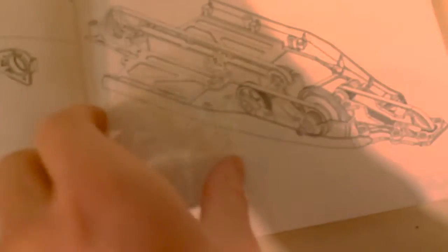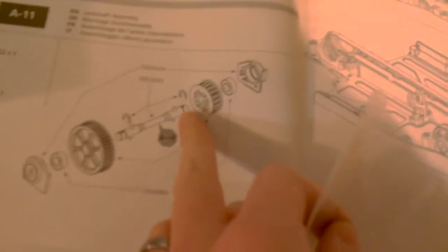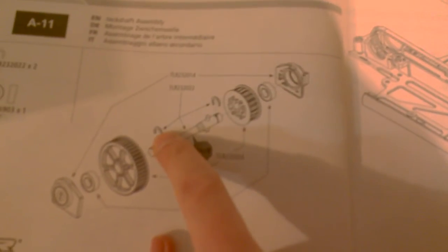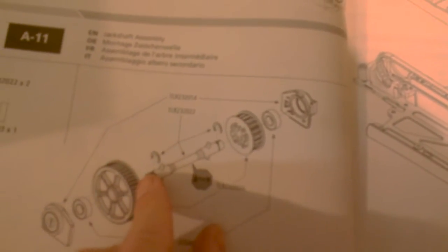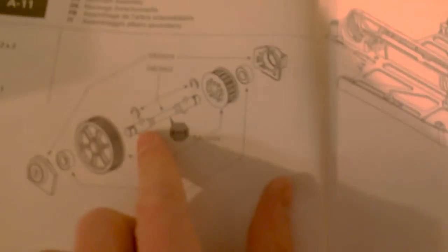To a first order, you'd think that's not a problem. It snaps onto the little slot on the shaft just as easily as an E-clip. The problem is, if you need to, say, change the pulley, if the pulley wears out, it's a lot harder to get this out, because with an E-clip, you at least have a notch that you can dig the pointy end of a knife or something into to pop that E-clip out. Here, the whole clip wraps around this sort of notch in the shaft, so pulling that clip out is going to be more challenging.